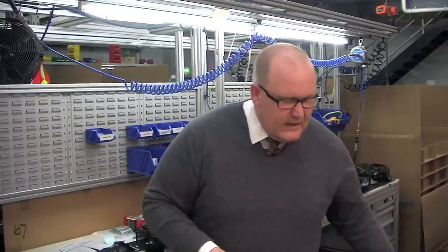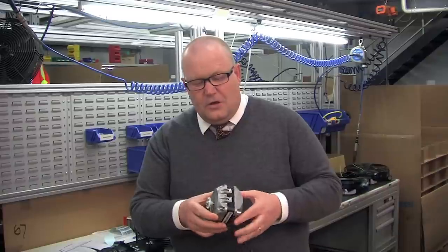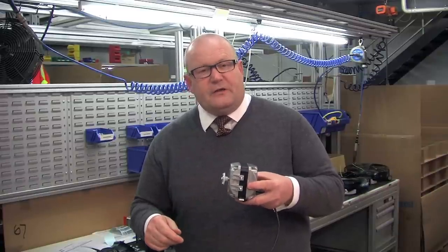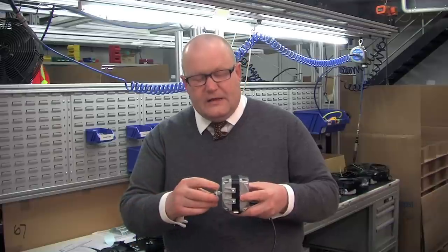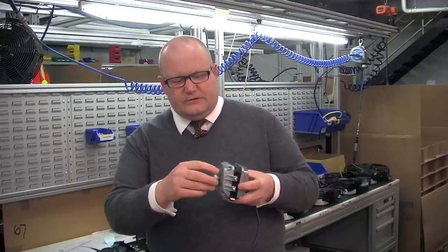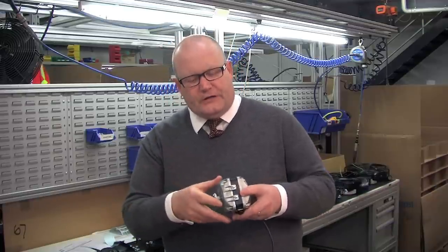There are obviously other types of AC motors. There are three-phase motors which can be up to 500 kilowatt, for instance, or even small shaded pole motors like the one I've got in front of me here, which is just a 5 watt motor. This is an internal rotor motor — in other words the inside of the motor rotates — and it's a shaded pole product. We use a copper wire inside the product to shade one of the poles, one of the magnetic poles, which again allows the product to start.